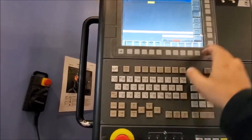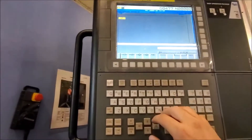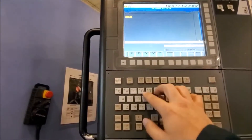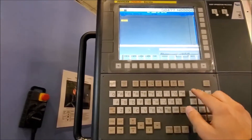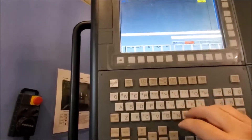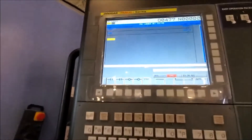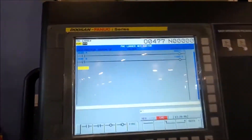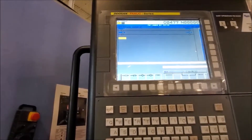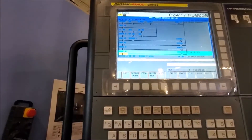There you have it. And then we're going to create another net which is normally closed, and it's going to be R7.3 — which is the button — outputting to Y7.7. So here we go, this is the basic structure of it. Now we exit the edit, and you can see our two rungs right here. Notice how the rungs have pretty much useless names — these tags are not helpful at all to help you understand what's going on.